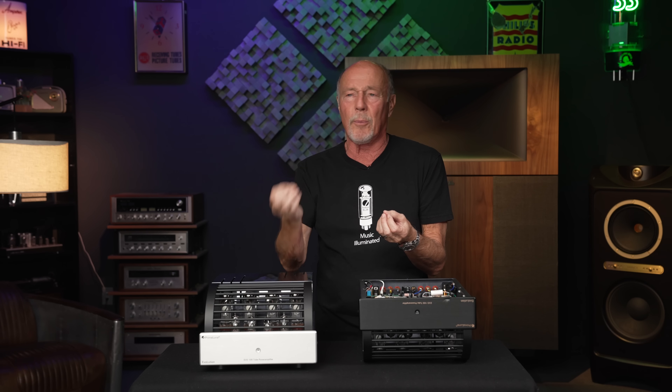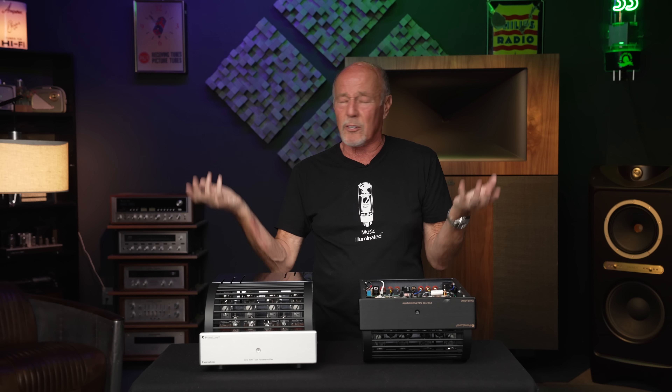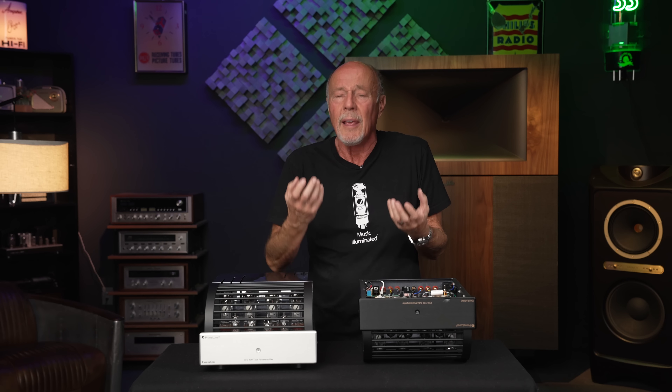Power doesn't mean a thing. If I were to put KT120 tubes into this amp, it's only going to give you about 45 watts per channel. There are manufacturers that give you 100 watts per channel from KT120s — what does that mean to you as a consumer? It means you're going to go through tubes faster. The only way to get 100 watts out of a pair of tubes is by running the plate voltage higher. PrimaLuna's credo for over 20 years has been to run the tubes at the lowest dissipation without going into crossover distortion.